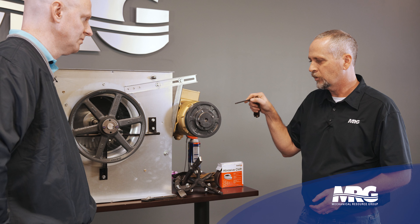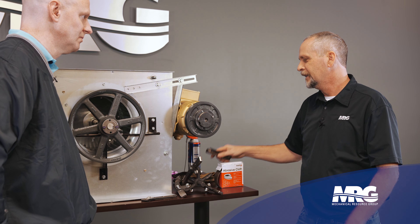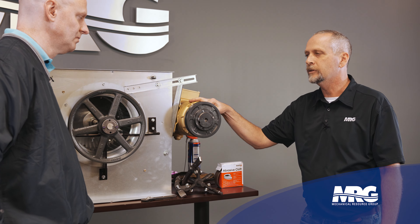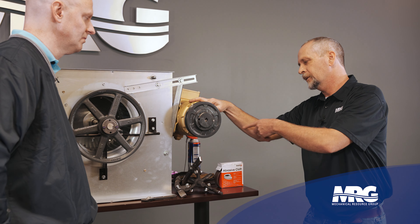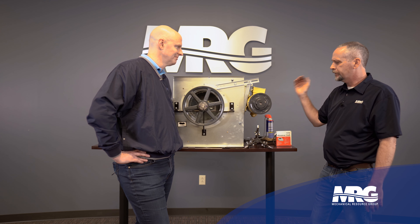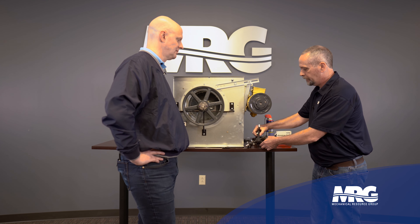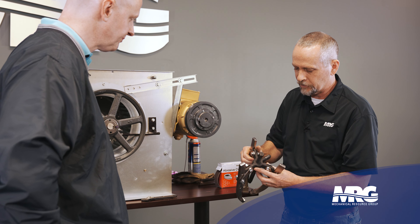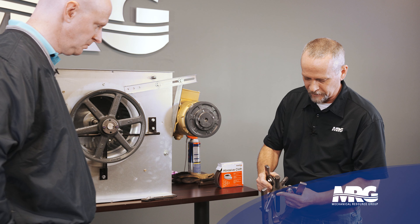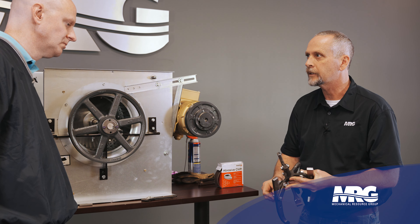It's easy to go too hard with your Allen wrenches and strip those out, and then you're really screwed — you're having to drill them out. When you get to torquing on that, if you've done them a few times you'll know about the point where it's about to round out, so just be careful. If you do strip it, you're going to drill it out — you don't really want to put heat on it being that close to the motor. So we've got our set screw loose, and now we're going to use a three-jaw puller to remove this sheave.